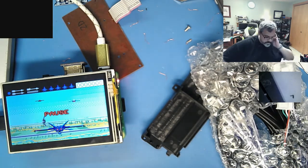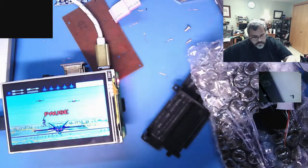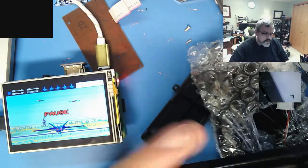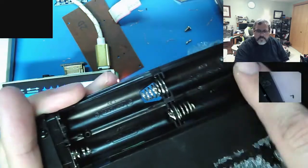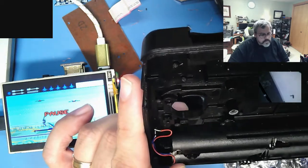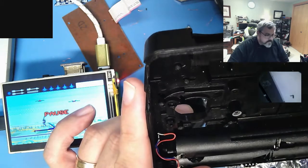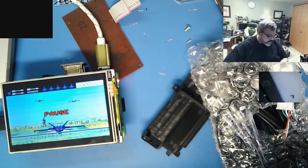Yeah, I'll think about that. Probably will work. Just one pack will do it. Otherwise, I'll see if I can jam 2 of them in there. But I'll have to modify a bit more plastic to get there. If I cut this out, I have enough room to put 2 packs in, which should give me over 6 watt hours. It'll give me 12 watt hours, so 4 hours of play. That's not too bad.